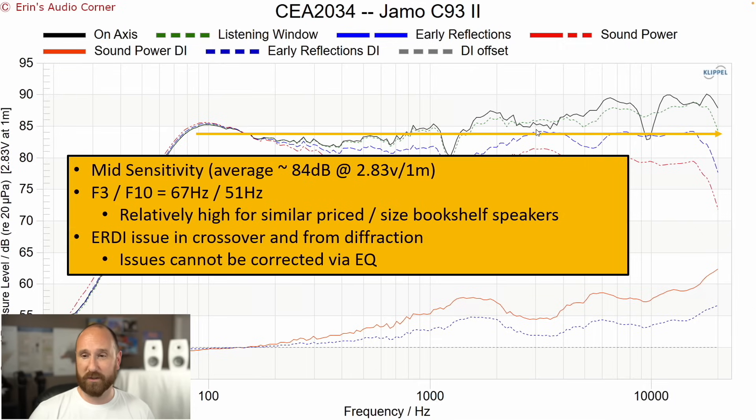Then around 3 kHz, but at 2 kHz you're about plus 3 dB. At about 6 or 8 kHz, you're anywhere from 4 to 5 dB. And then at about 12 kHz, you're about 6 dB over the mid-range. So it's just bouncing all over the place. That's going to really mess with the overall timbre — not only does the mid-range sound softer, but the high frequency is going to accentuate or soften things that it shouldn't.